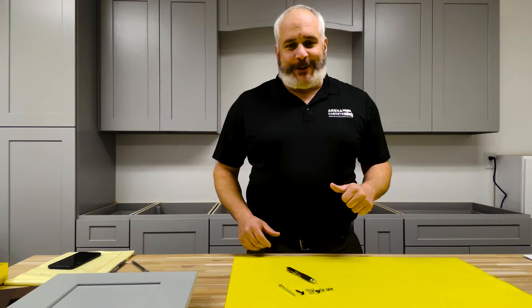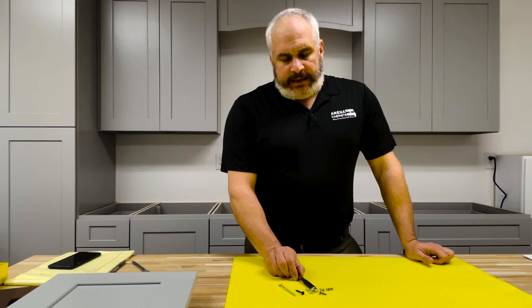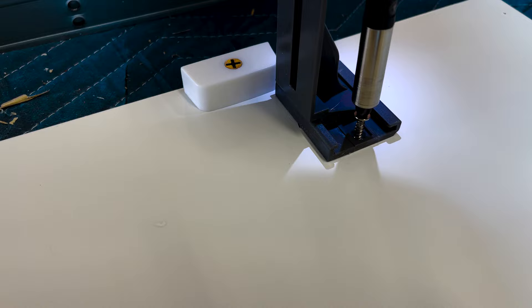This fourth one here we use for drawer slides, mainly side mount. That's something else we'll talk about in another episode, but for side mount drawer slides these are perfect for setting the slides into the carcass or the box of the cabinet and getting that all secured together.